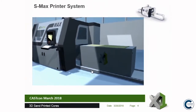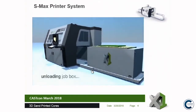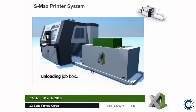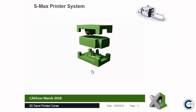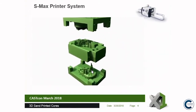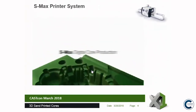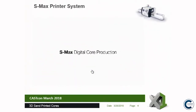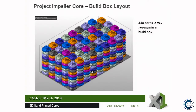If we're using a medium-grained sand, it would take 17 hours. The sand inside the box can be completely recycled. Here we're showing one mould package with a core — this is a furan binder system, so it's ready for casting. I hope that was a good enough explanation. We'll carry on now with this application.